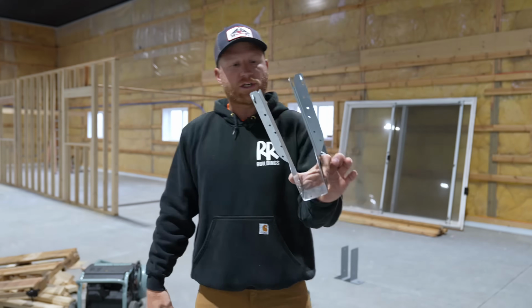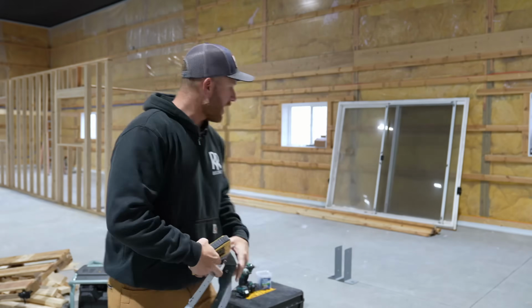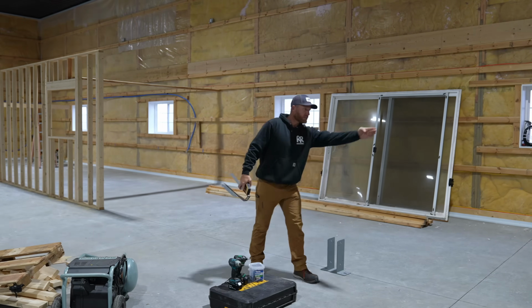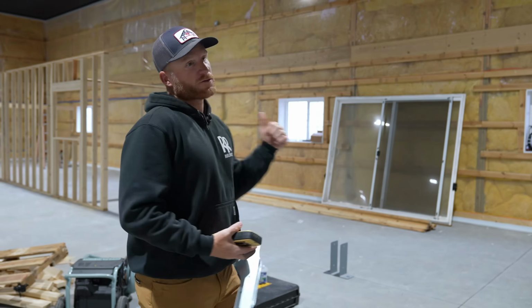So we've got these joist hangers. We're gonna be using an engineered I-joist, and we've got all this top header here on the wall back here marked, and we are going to build a beam that's gonna sit on this post here. So this is a 16-foot span. We're gonna do an engineered LVL, double LVL beam, and then we'll get all those hangers mounted. And by the end of today, we should have a lot different look back here because we should have minimally all the I-joists installed. Maybe we'll get into some legacy subfloor sheathing, but let's go ahead and get into it.